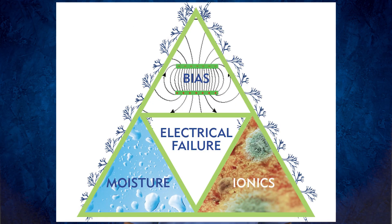So what exactly is a tin whisker, and how is it different from a dendrite? In a previous episode, we talked about how dendrites are the consequence of electrochemical migration. When moisture exists between two electrically biased conductors, electrochemical reactions occur — a form of corrosion — that leads to the formation of dendrites. However, in the case of tin whiskers, no water or electrical bias is required.